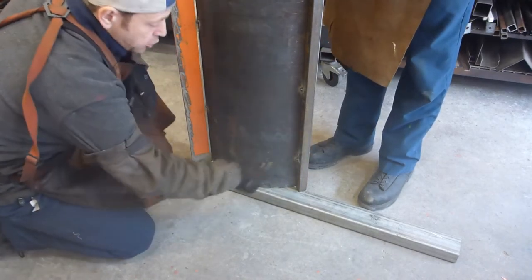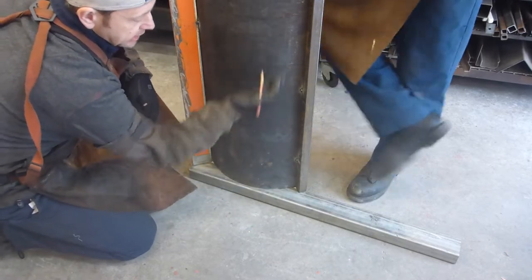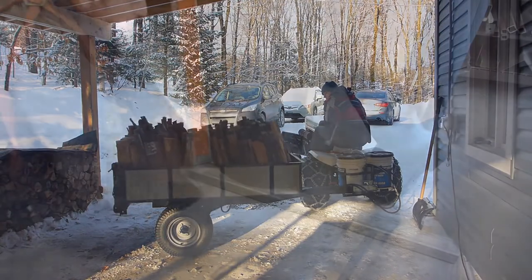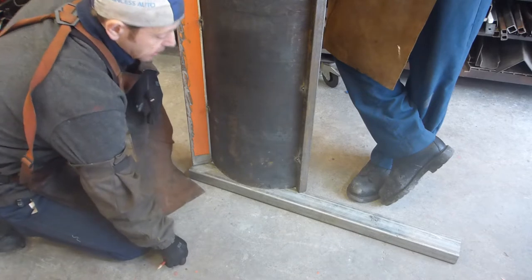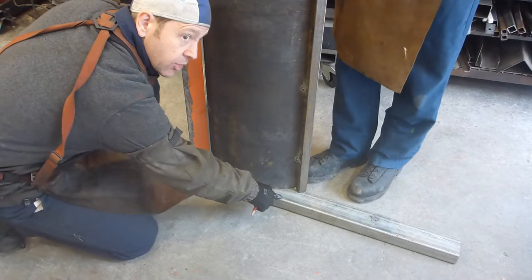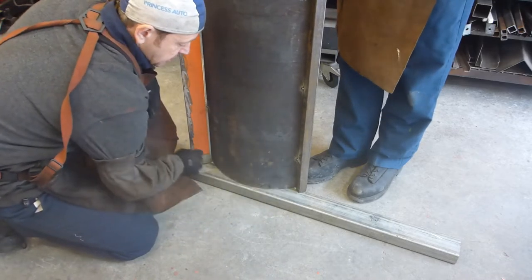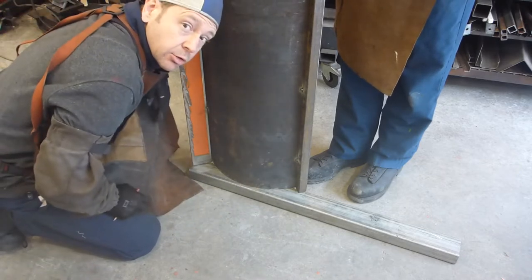For the next part, what we will do is some reinforcing ribs, not on the side exactly, but where the skid steer will attach. So to be able to have a flat surface on which we will be able to work, we are going to cut that opening into that. This is a 2x3, 1/8 or something like that. So cutting it to this specific dimension, making a duplicate, so we will have two flat surfaces on which we will be able to work.